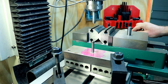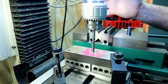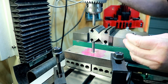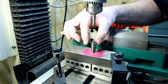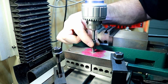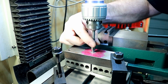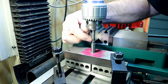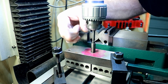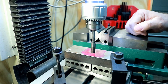I can take this back off. Then I can bring this pin here down — as you can see, it's way off. I can visually eyeball where that needs to go. But I have a sleeve here that just fits this and it fits this one. So if I bring these down just a little bit, I can use both hands. Now these two are in a line within a thousandth or two. Looks actually pretty good — doesn't bump, makes it all the way down. We're good.